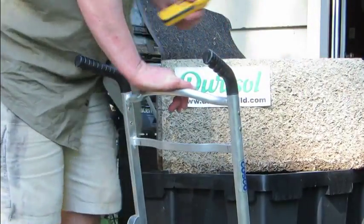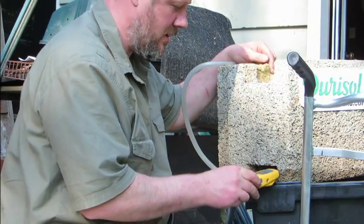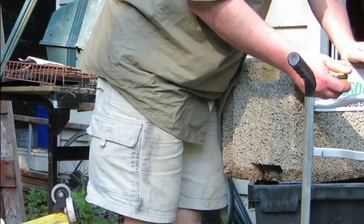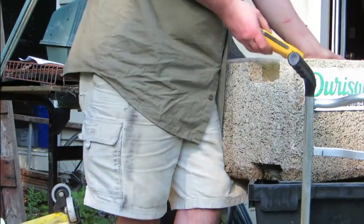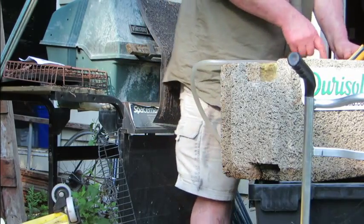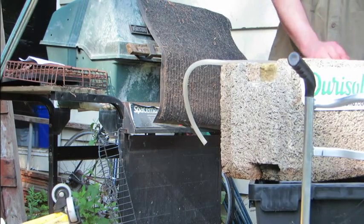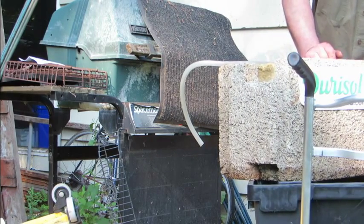The concrete is wetting from behind. Turning it again, we're at 100% at the bottom. Up higher, we're at 19, then 11, and at the top we're at 12, 14, 14. The concrete itself - and I'll take a photo - up at the back half it's at 100% because one of these holes was spraying into that area. And yet if we go just a short distance, it's still only at 12. So it's 100% here, and within 4 inches it's at 12.